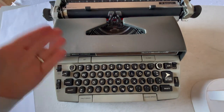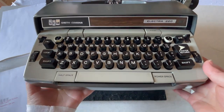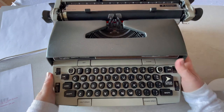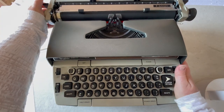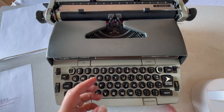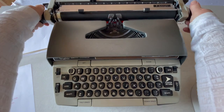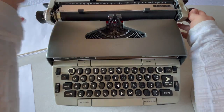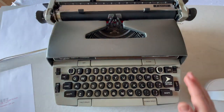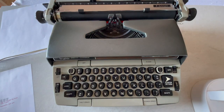It's not missing a handle — well, it is missing a handle but it's supposed to be that way. It has a power return on it. For those wondering about the difference between the 220, 120, 210, and 110: the 200 series has a power return, and the 100 series has a handle. The '20' part means it has an extended carriage — we call it a 12-inch carriage, though it measures 15 inches handle to handle. The 110 and 210 have a 10-inch carriage.